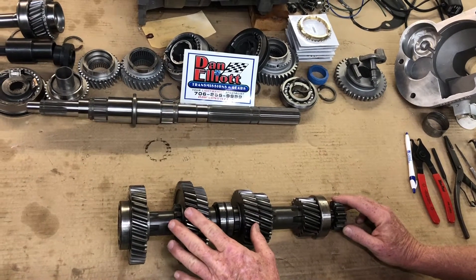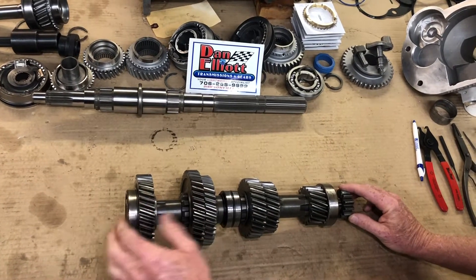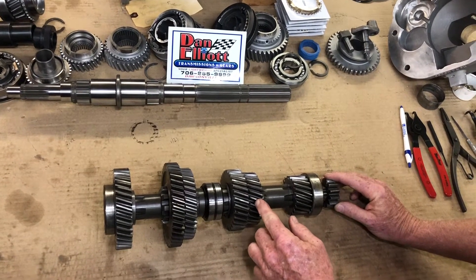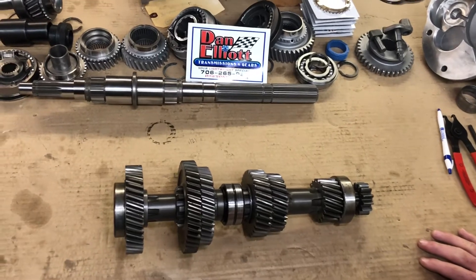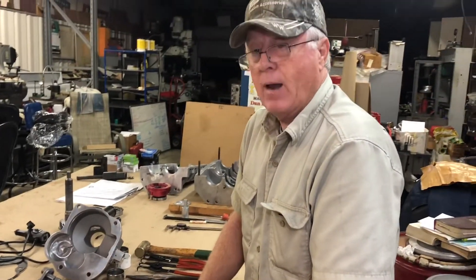You can also take pictures, videos — whatever helps you in getting yours back together. You want to be able to mark the gears on the front. Some gears I'll have to get off the shaft before I can mark them, but just make sure you do that before you start washing or whatever process you're going to do. Some people may micro-polish the gears. I'll either micro-polish or bead blast, so I'll show you what I do before I do that.